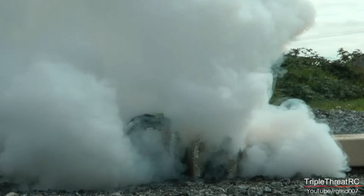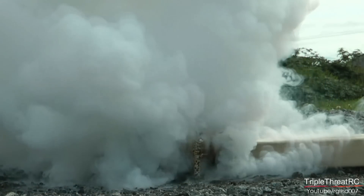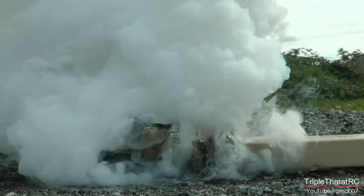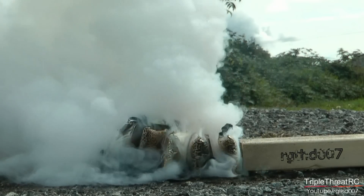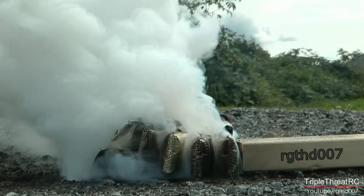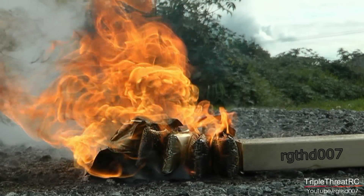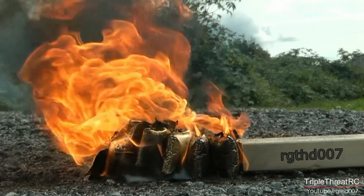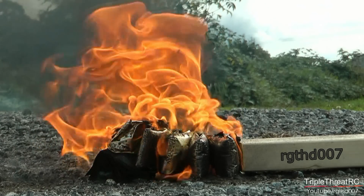Unfortunately we screwed up a little bit. We took the other lipo that was fully charged and put it on the charger to discharge it down to 3.85 volts. As soon as it got there we ripped it off, but it turned out we ripped it off too soon and didn't leave it on long enough to stabilize at 3.85. When we tested the voltage just before we spiked it, it was actually at 3.95. So we went ahead and spiked it anyway and the reaction was still quite violent — we missed the opportunity to show you what reaction the lipo would have at storage voltage, which would be considerably less. So we're going to have to do a do-over and bring that to you in another video.